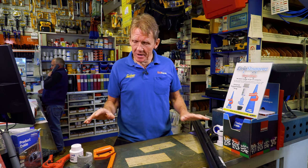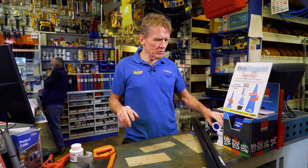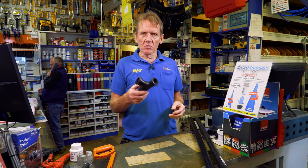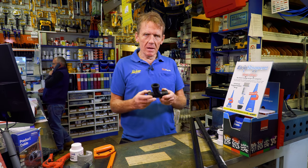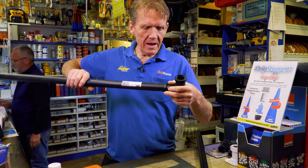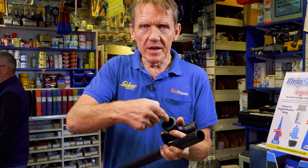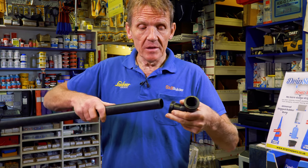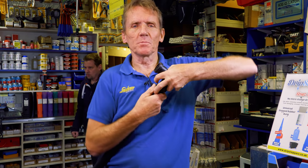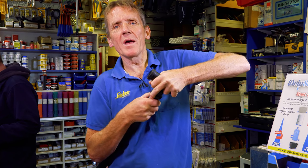We're going to show you a little bit about how to cut and join waste pipes. It's a confusing world really, because at any time if you're a plumber you can go to somebody's house and come up against a variety of different waste pipes. What we have here is what I'd call fairly nasty stuff — this is polypropylene pipe. It's a push-fit system; it will not allow you to solvent weld it. There's an O-ring inside and it's done with a push fit. This stuff moves about and expands and contracts and causes all kinds of problems, which is why I don't know any professional plumbers who actually use it.